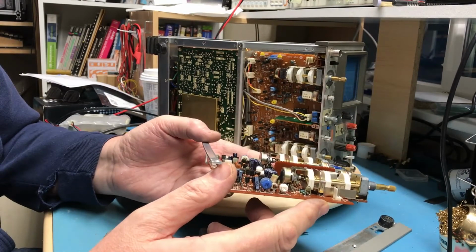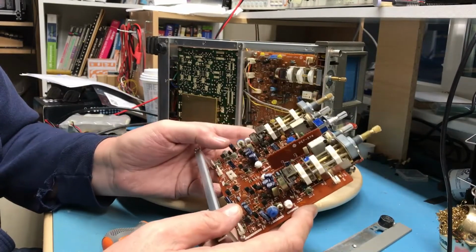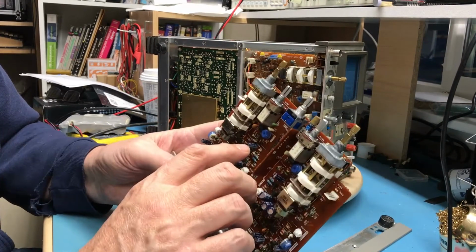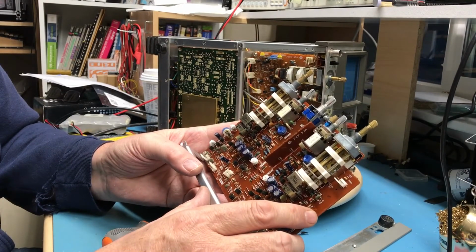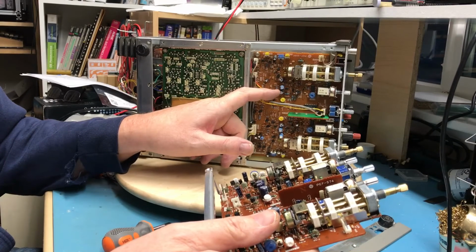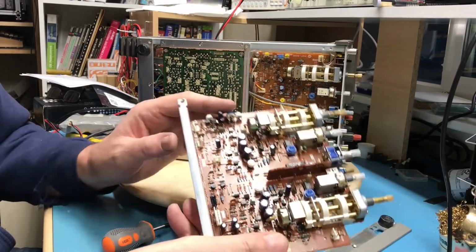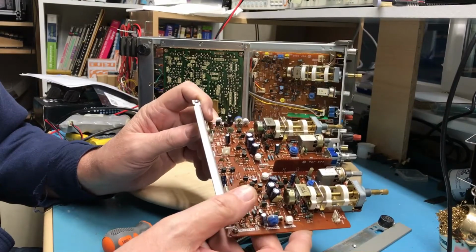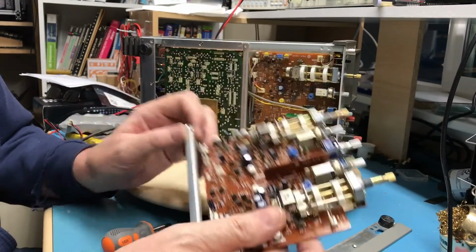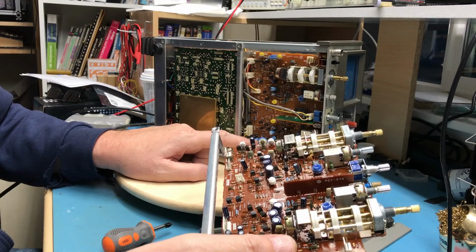So I'm really tempted to go ahead and order up, either look in my stock for replacements or order up the ones I don't have. I don't know if I have 100 microfarad 25 volters. I would have to go look. Let me say, looking at this board, just because there's a different one sitting there, and he's much shorter. And there's two different ones here. I'm sure it wasn't manufactured like that. You know, all the caps here look like they're potentially the same manufacturer. It's hard to say. And these are, you know, shotgun mess. It's hard to say.